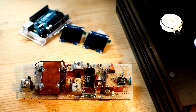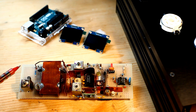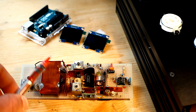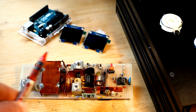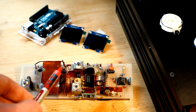The signal picked up through the antenna — the antenna will be connected here — is first filtered by this coil. We also have a varicap diode in parallel. Varicap diodes are capacitors which can change capacitance based on the applied voltage. After the first filtering, the signal is fed into the first amplifier, based on a dual gate MOSFET — here I have deployed a 3N-201 MOSFET, with a little bit of shielding. The signal is then fed into the second filtering stage with another coil and a varicap diode in parallel.